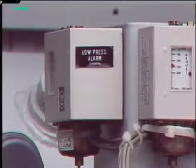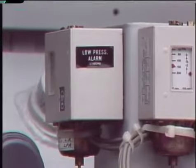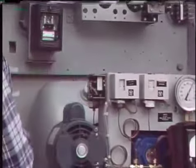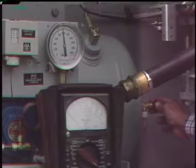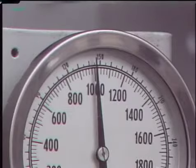The low pressure alarm switch gives a warning that system pressure is getting low — if the pressure falls too low, the breaker may not operate when needed. To check the setting, de-energize the compressor, connect a volt-ohmmeter to the switch terminals, and slowly bleed system pressure until the meter indicates the switch has operated. Note the pressure, and if necessary readjust or replace the switch.